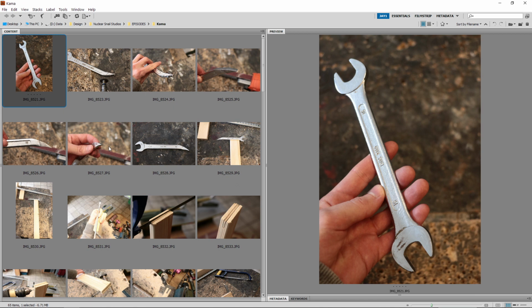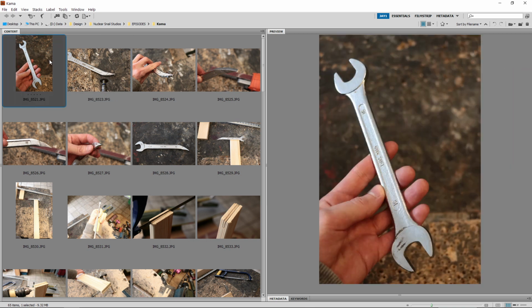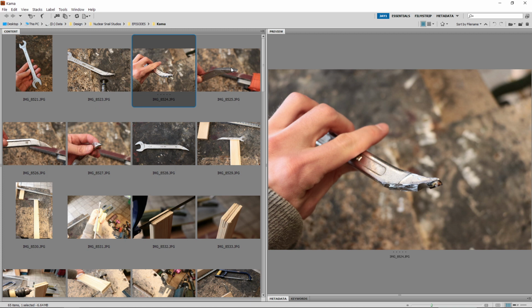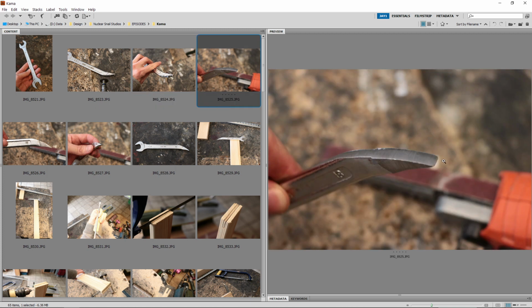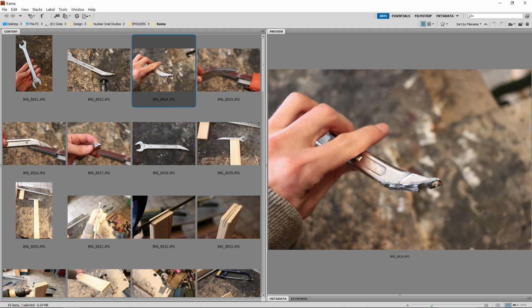Here's how I made it. It was actually a pretty straightforward build, although I had to take some time to figure things out regardless. So first I wanted to have this wrench be the metal bit on this, and I just took my metal cut-off wheel on a rotary tool and chopped off a part of it, leaving a part of this right here, looking like this. I polish it up a bit using the power file so that I don't cut myself when working with this further, although it's still obviously a bit sharp here, but not this nasty, which is what it looked like just after the cut-off wheel.